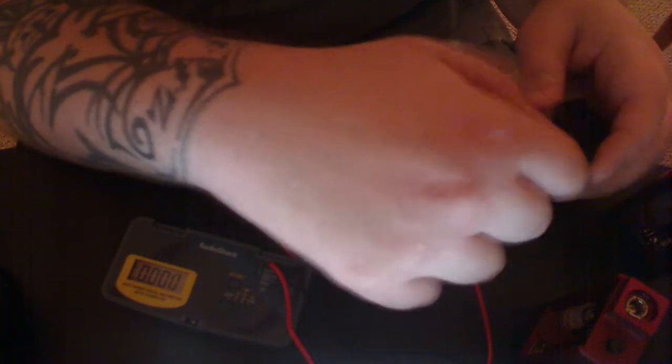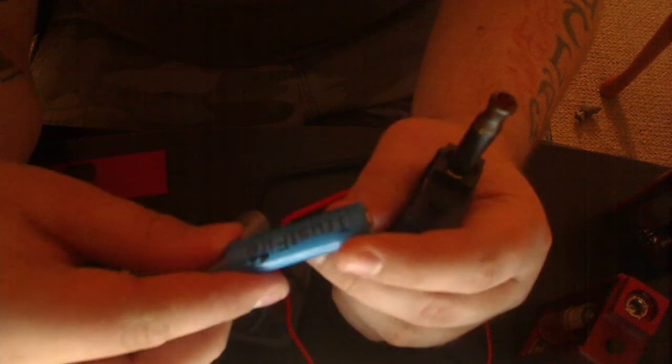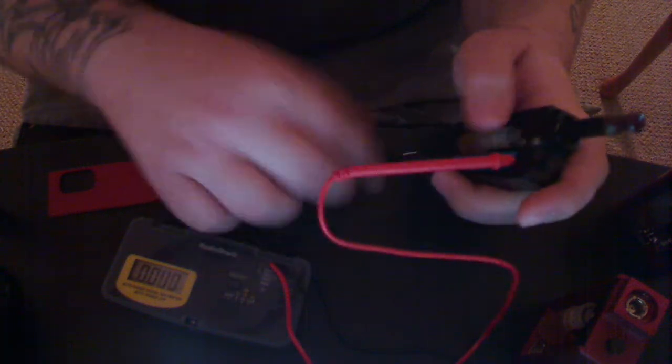Let's do one more comparison with the Mini. Let's put an atomizer on the Mini. The batteries I'm going to try in here are a TrustFire 3.7 volt 14500 at 900 milliamps, and an Ultrafire 3.6 volt also at 900 milliamps. Let's check the blue TrustFire first — loaded and unloaded.